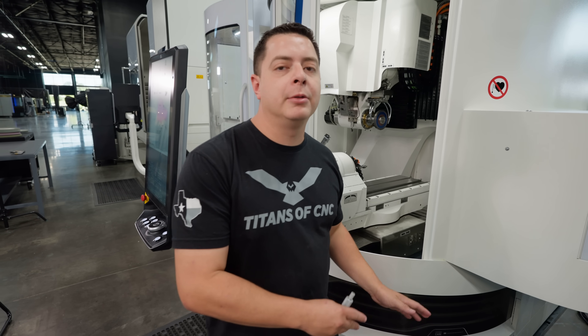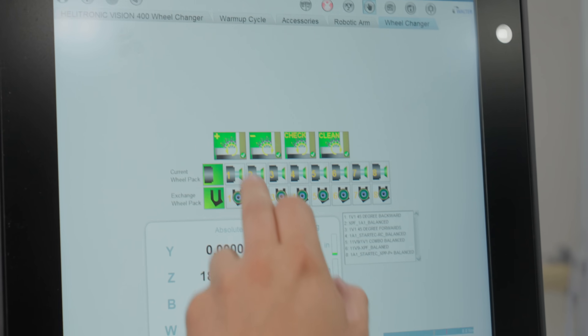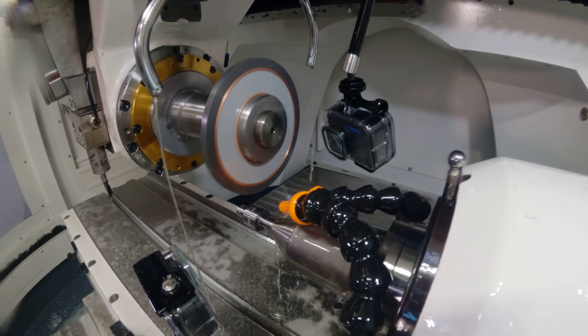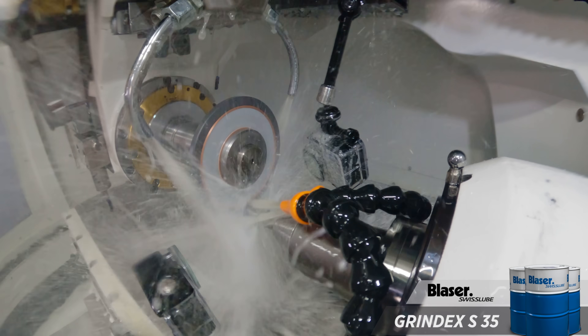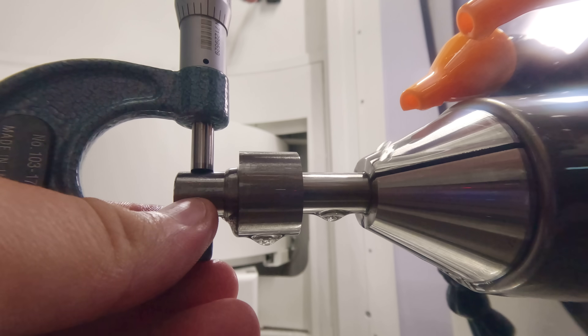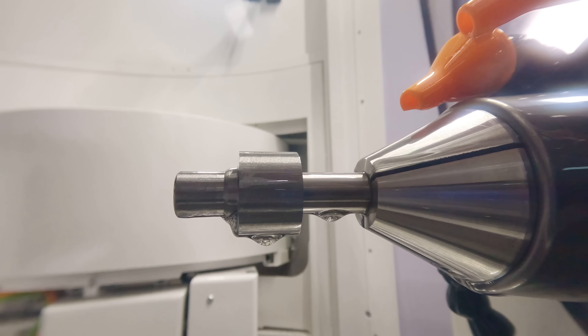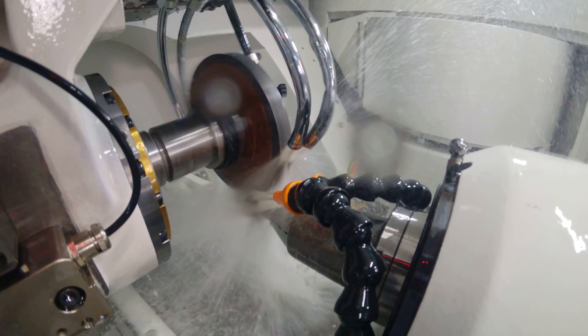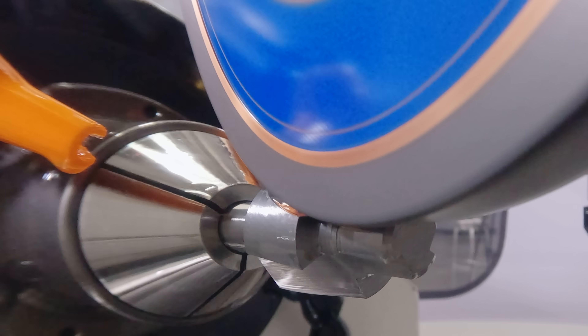The good thing about the Walter Vision is that it comes with an eight-wheel tool changer. I already had the XPP Plus located in there, so all I have to do is load it into the program, make sure it clears, and I'm good to grind. Now that my contour grind is complete and I'm on size with my part, I can switch over to my RC wheel and start my fluting passes.